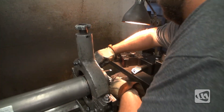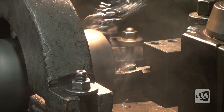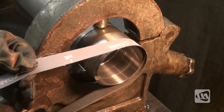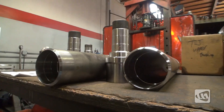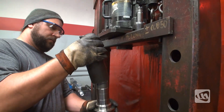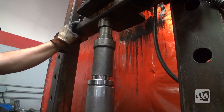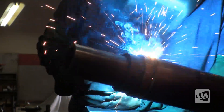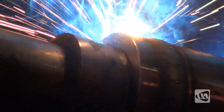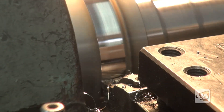The bore will now be measured and checked against the sides of the spindle to ensure they're within spec and allow for a precise fit. The tube will then get prepped for welding by breaking the edge on the inside and chamfering the outside. With the tubes cut down, machined, and ready for welding, it's time to have the specially made spindles pressed into them. Time to get them welded on. To finish up the tubes, the welds will need to get machined off and then set aside to cool before proceeding to the next step.